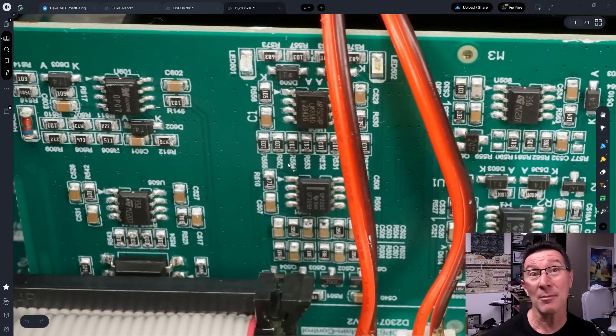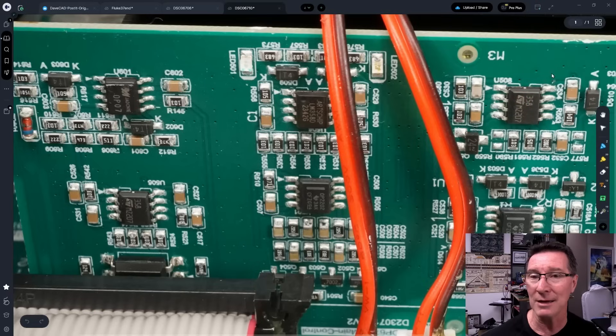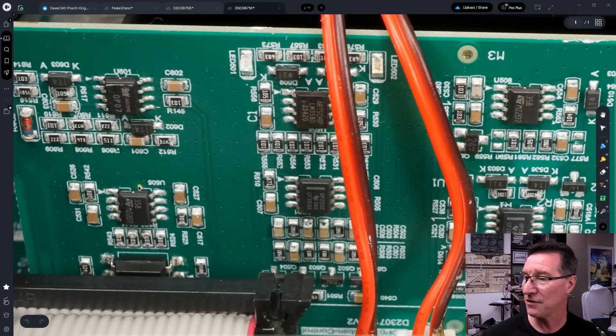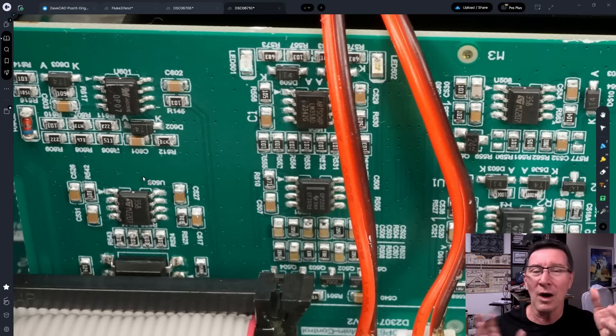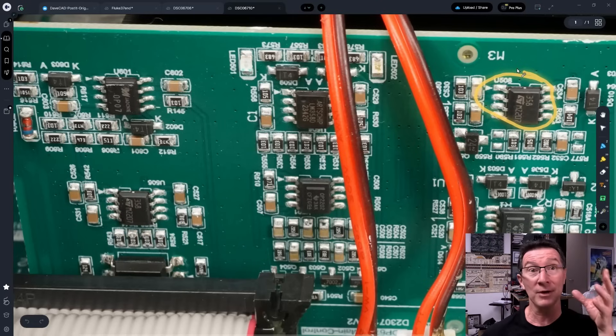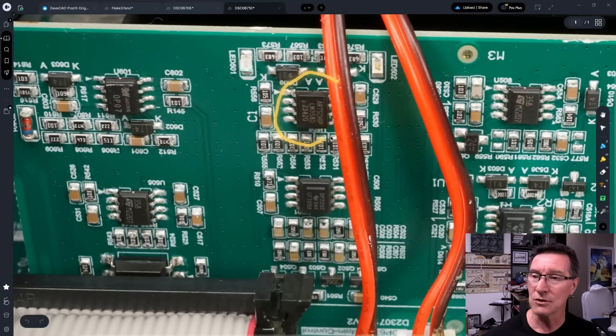The question asks: why are there different brands of LM358 chip? You can see LM358 there — that's an ST, one of the big reputable manufacturers. Got another one down here from the same batch — MZ207. That would be a batch code; every manufacturer has a different way of doing their batch codes. They'd basically be from the same physical reel on the pick-and-place machine. But look, this is also an LM358 — it's from a company called ArtsChip. Have you heard of ArtsChip before? Probably not, because the LM358 is what's called a jellybean component.